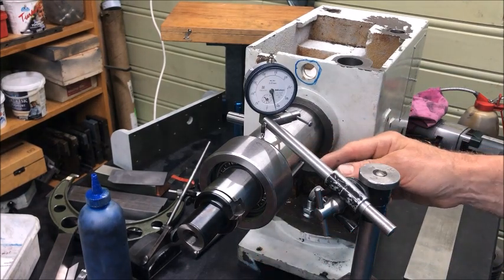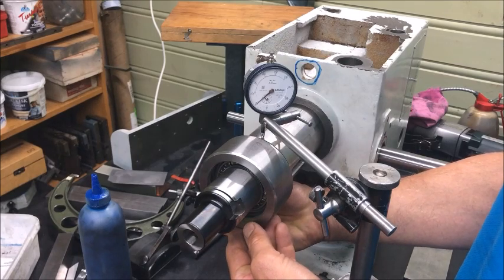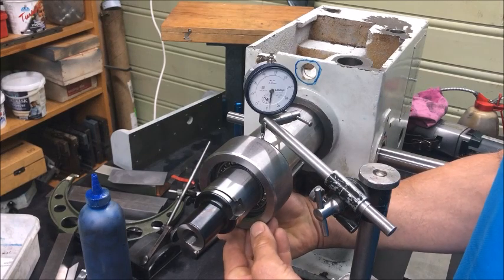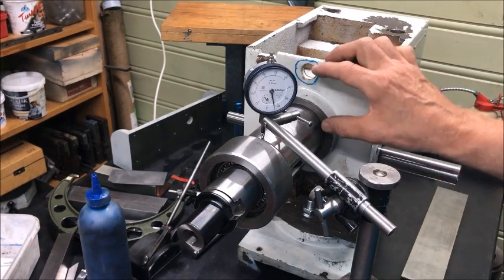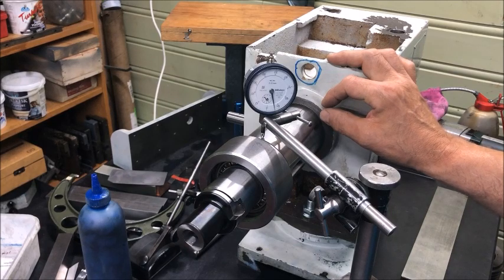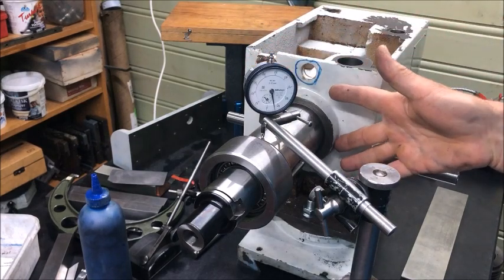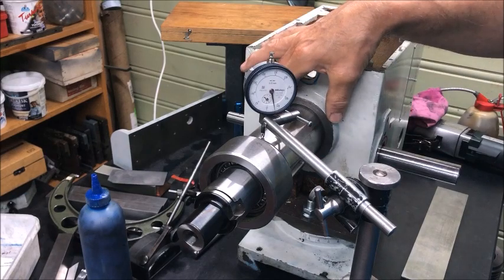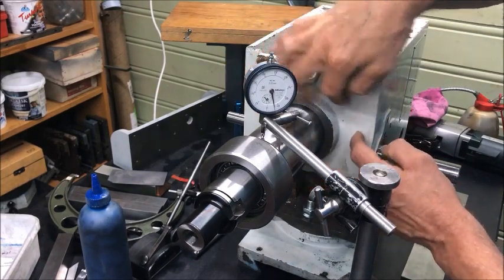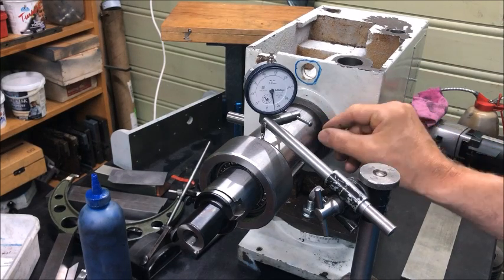This is of course at almost quite far out. If I push upwards, this is the amount of slop you have. Ideally we will rectify this by adding a sleeve here that you can mount here — that's one idea. Ideally this bore should have not been so sloppy. To rectify this, you could think about adding a sleeve around here, bolt it here, and then either reducing the amount of throw you have on the spindle by adding the sleeve on top, or milling down — whatever. There will be a sort of sleeve here which connects to the scale, but that's really just very, some millimeters.